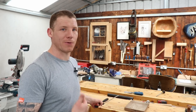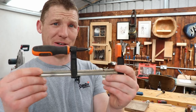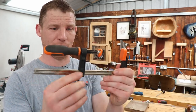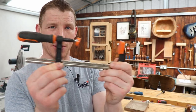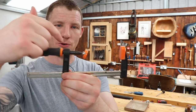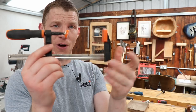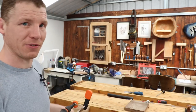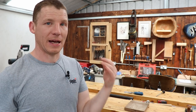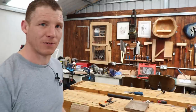The mechanism now uses a cam lock — which you've seen in the first two videos — combined with a second mechanism that works exactly like most woodworking bar clamps or parallel jaw clamps. If you keep this part nice and straight it moves up and down the bar, but as soon as you tilt it, it locks onto that bar, allowing you to drive a screw against it, giving a wedging action. I've taken advantage of this principle with the leg vise in tandem with the cam lock to give us our force instead of using a screw.